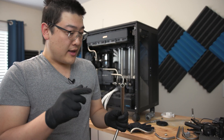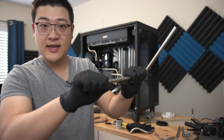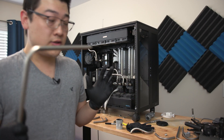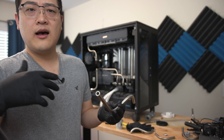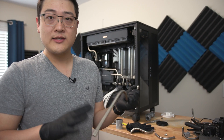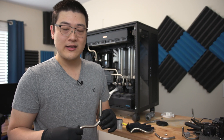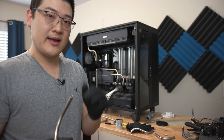The 12mm, 0.5mm wall thickness tube is easier to cut and easier to manipulate — it feels a little softer. It's still very stiff being stainless steel, but just not enough to prevent crushing during bends. So you can cut it and use it on straight runs just fine, but if you're going to be doing bends you probably want one millimeter wall thickness. If you go up to 1.5 or 2mm wall thickness, the tube is just too thick and too difficult to work with. I'd stick to one millimeter for 12mm OD, and I'd imagine that holds true for 14 or 16mm OD as well, though the dynamics change slightly with a bigger tube.